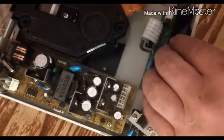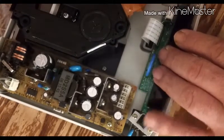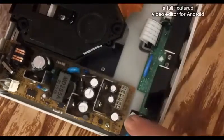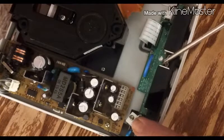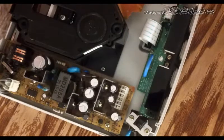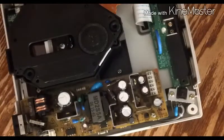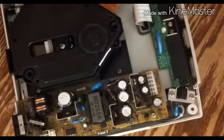Another thing I did that I didn't tell you about is, before I opened it up, I turned it on once and watched the light turn on for a second and then buzz out, because there's still power in these caps over here. So, yeah, you definitely don't want to touch something and either fry the damn thing or fry yourself. Yeah, that would suck. Give me a second here and I'm going to throw this thing together.